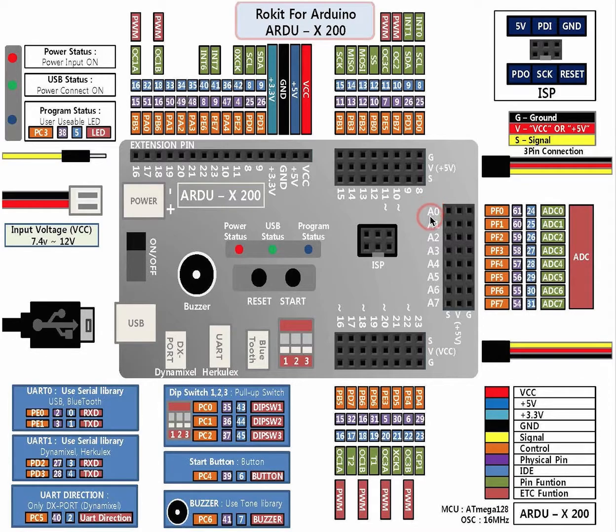Next, we have analog pins. The analog pins are generally called out through either these numbers right on the side over here or these letters over here. So you can call them A0 or pin 24. I would still call out to that when you're doing your coding. Another thing is your analog pins are generally reserved for sensors. Your digital pins are more for physical components that do things such as motors or LEDs, things along those lines.